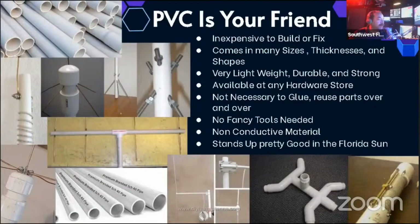I've never glued one of mine because I take them all apart and reuse my parts. I have parts that have been used on 4 or 5 different antennas. So you don't have to glue them, and you can reuse your parts over and over. No fancy tools. I just took a bunch of Yagis that I had and turned it into a 10 element 440 Yagi that I built this last weekend. It's up there now shooting towards Verna, trying to get the NI4CE, and it's doing pretty good.